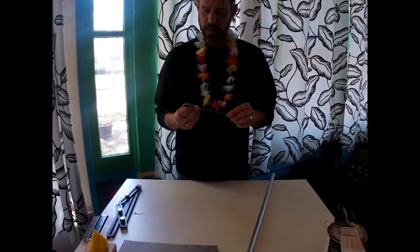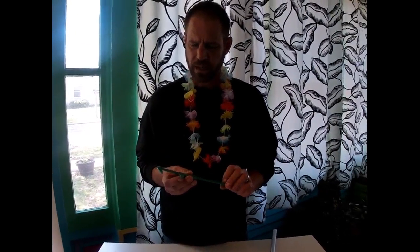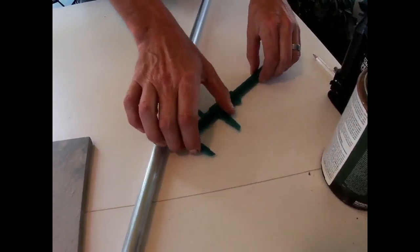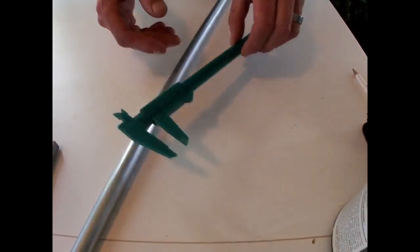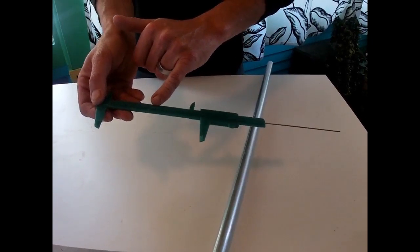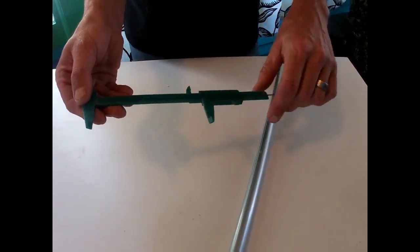The first tool is a plastic little vernier caliper. I bought this thing about 20 years ago and it has been an invaluable tool — just wonderful to have. It's a simple measuring tool with outside jaws for measuring outside diameter, inside jaws for measuring inside diameter, and a little pointy thing at the end for measuring depth. It comes in increments of both standard inches and metric centimeters.